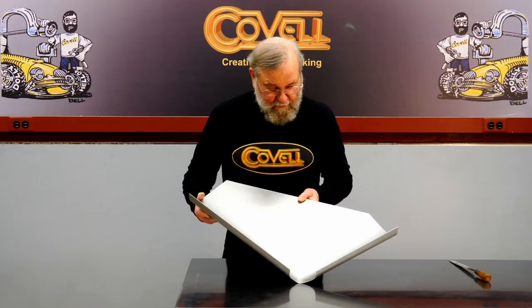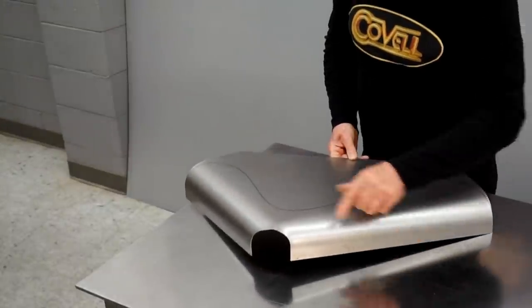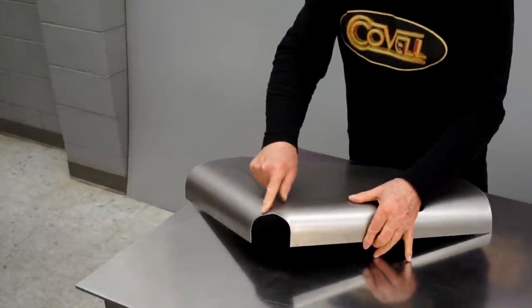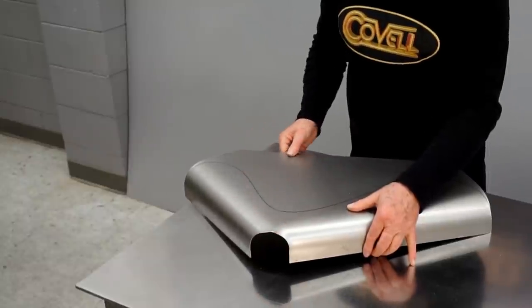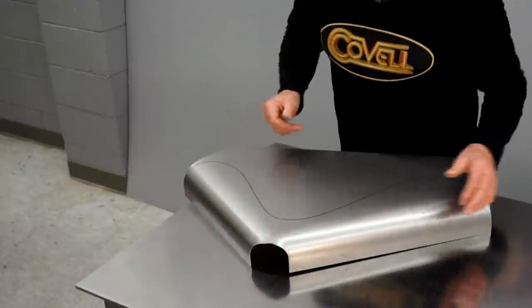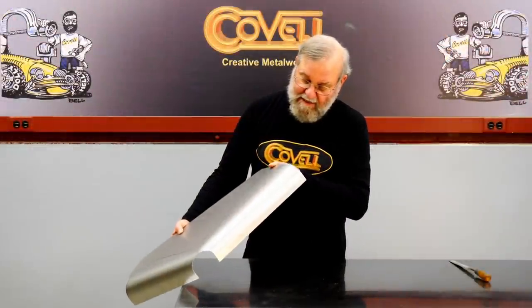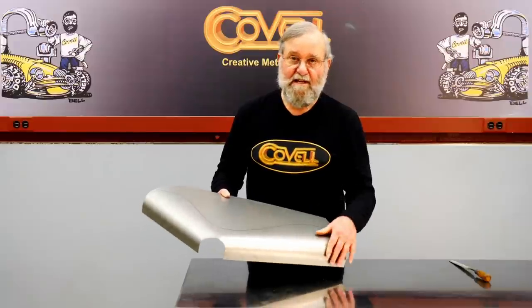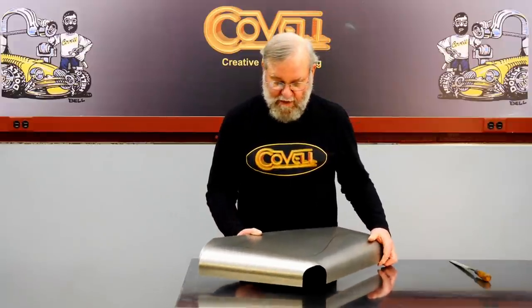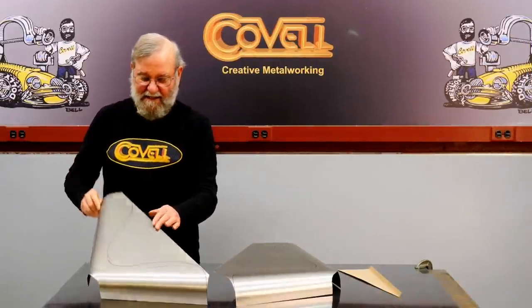There's the part with both bends in it — it looks great on both sides. There is a little bump here, and once the seat is put together I'll use a hammer and dolly to smooth it out. I don't want to do it now because hammering it down would open up the angle a little bit. But look at how beautiful that curve is. It's very difficult to make a tapered curve with accuracy unless you bend it over a form, which is why I took the time to make the wooden form. I used the same procedure to make the second seat side — that's a done deal.